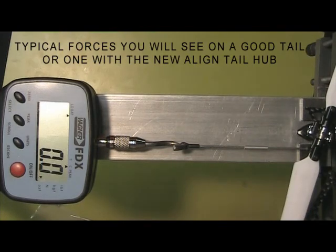We saw there nice, crisp motion — 12 to 13 ounces at both extremes of travel, smooth, no stickiness anywhere. So all that was just to get to the point where we could actually design the Chinese weights for these to drop that 12 to 13 ounces down to a reasonable level.